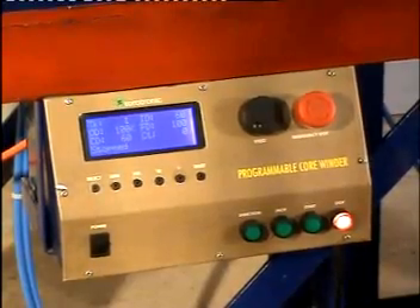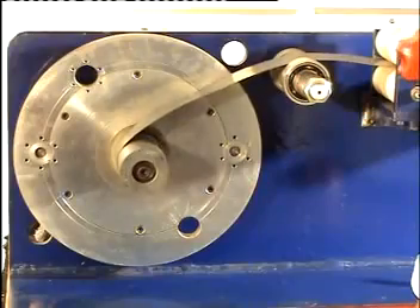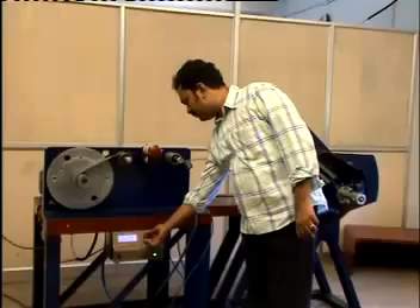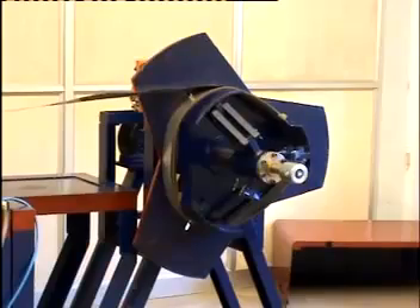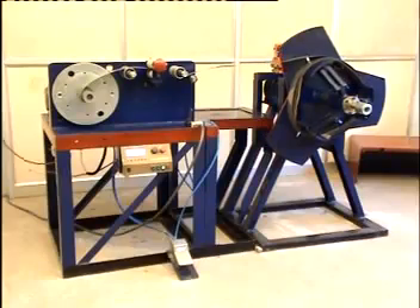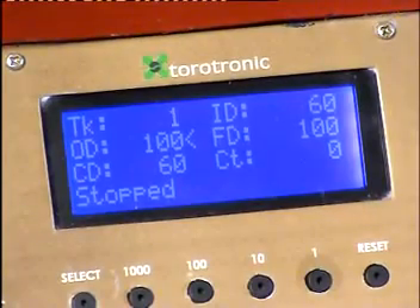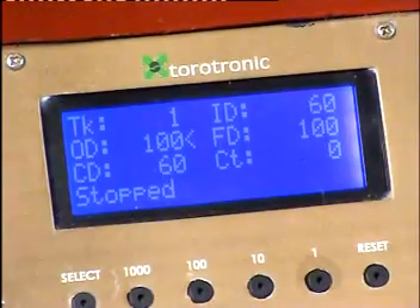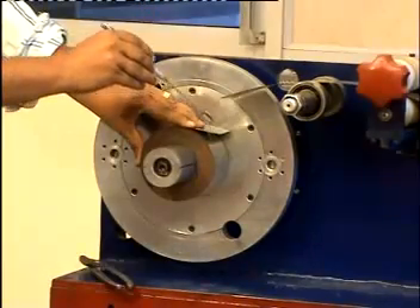After programming, rotate one rotation using the inch button. Simultaneously adjust the brake to provide proper friction. Tack welding is done after one rotation. Now we begin winding by rotating at low speed. If the brake is okay, we can increase the core winding speed slowly. Now you can see the winding automatically stops at the required specifications — that is, the outer diameter of 100 mm which was programmed into the control unit. Now we will cut the steel strip and weld the core using TIG welding.